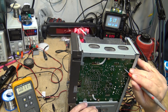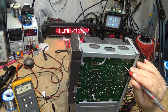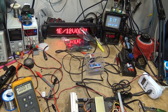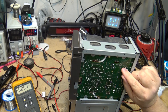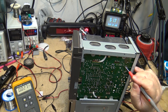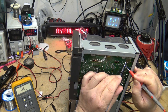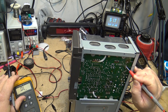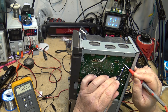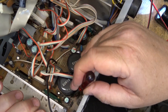Let me make sure the thing is discharged first. That's probably a small resistor — I wonder if that resistor has gone bad. There's another diode beside it too. Looking at that, one appears to be a resistor and there should be a diode across there. Let's see if that's gone bad. That's looking okay, resistor-wise. Two megs — let's take a peek at what size it's supposed to be. My meter showed two megs when I measured it in circuit.